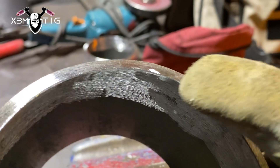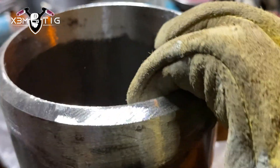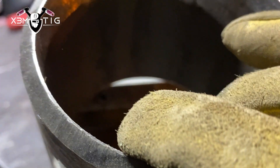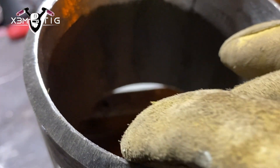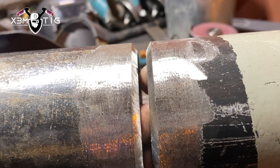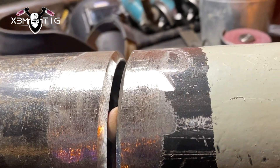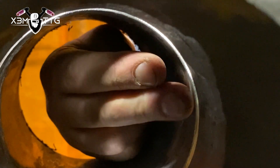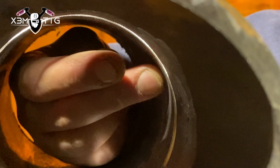For the cleanup, in and out, a couple inches from the edge, nice feather edge. Make sure that your pipe — whatever you're welding on — it's always clean, clean, clean. Especially with thick welding, it always has to be clean. For the lineup, if you got any high-low, I like to check with my bare hands.